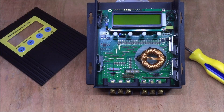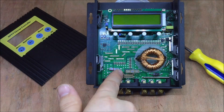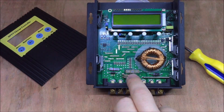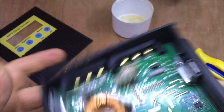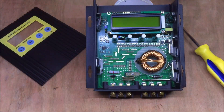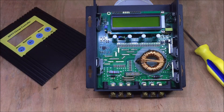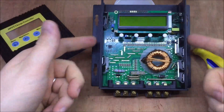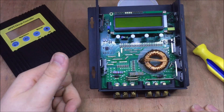Looking inside, there is a very big inductor which indicates that this is proper MPPT. What looks like two current shunts for measuring the current both coming in and on the battery. There is a fuse here which isn't soldered straight to the board — it's on spade connectors so it is removable. I believe this is a temperature sensor up at the top. The product is built into an aluminium case, which is actually used as a heatsink for the MOSFETs, insulated with thermal tubing — something a few people have had issues with.